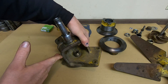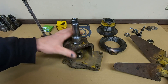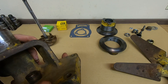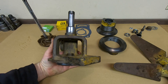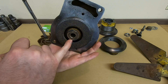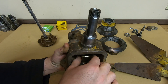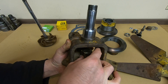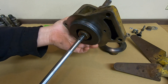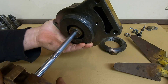I'm going to deviate from the disassembly process a little bit — I'll put the impeller and shaft in next because it'll be easier to guide the impeller shaft through that new felt seal without the pulley hub on there. First thing is to start the packing nut back on. The bushing the packing nut threads onto is still in very good condition — good fit on the impeller shaft, didn't have to do anything with that. Don't tighten the packing nut down just yet, and I'm not going to put any lubrication on the shaft — the coolant will handle that.